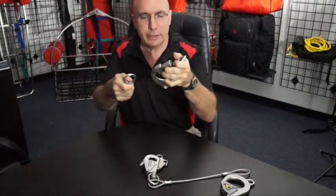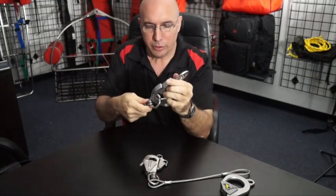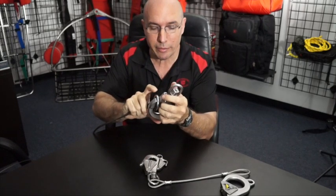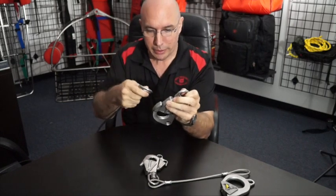But if you have a hook like this out in the field, the geometry matters. This lifting V-ring will come over the top, which is why we've added warnings in the sling owner's manual that this ring can roll out of this particular hook, so you have to be careful or pick a different device.